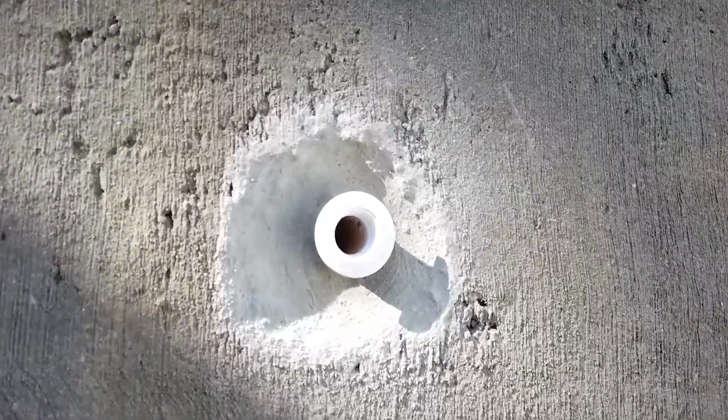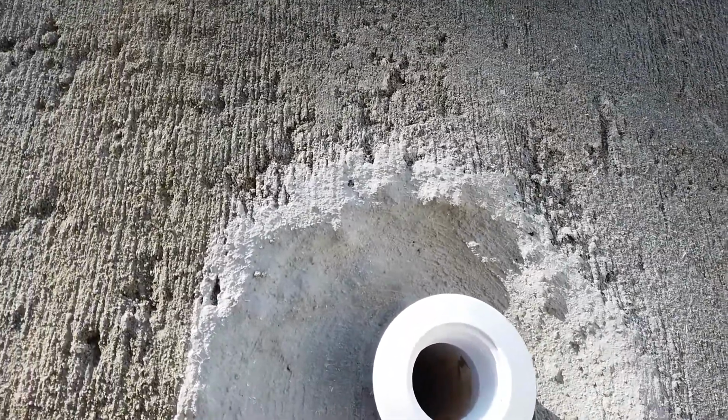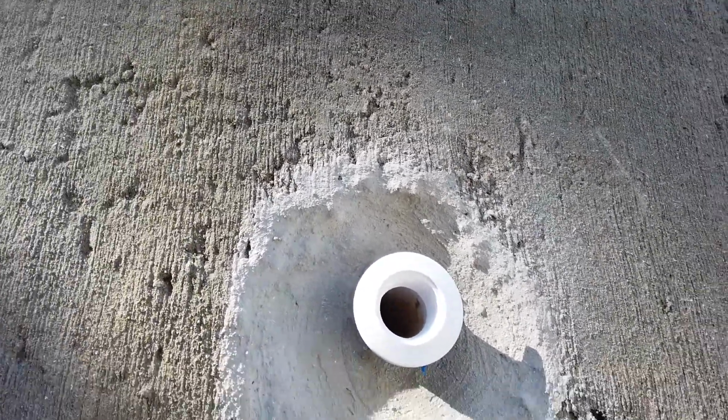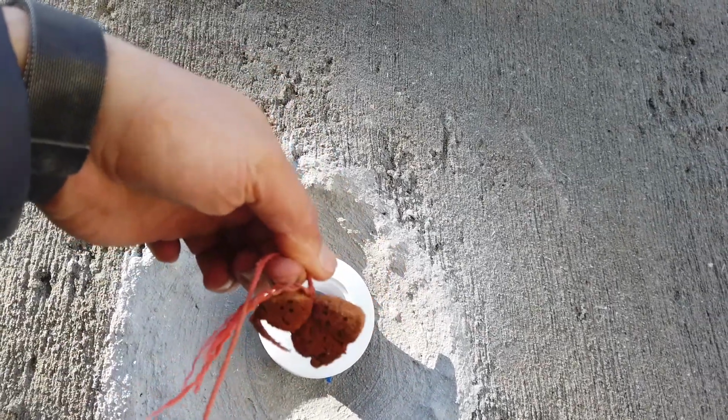All right, so we got a light. This is what's called a nicheless light that we're going to be running, and it's actually ran inside just a regular pipe. So what we're going to do is we need to pull a cable through it. So how are we going to do that? So we're going to do an old trick where we take a string and put a piece of, Paul, what's this called? Sponge. I forgot the word for sponge. So got a sponge on here, and we're actually going to use a shop vac, so we'll videotape that real quick and you'll see how it works.